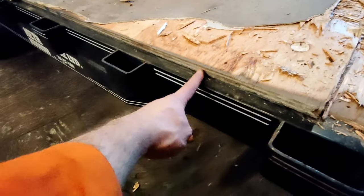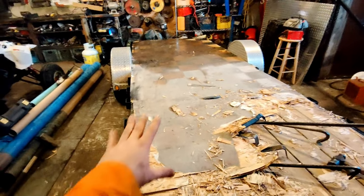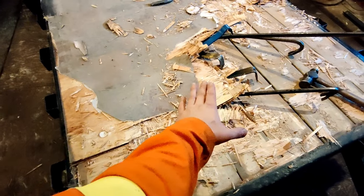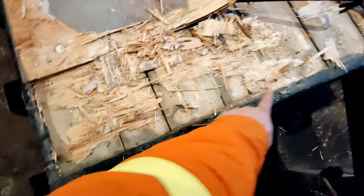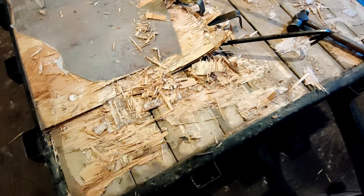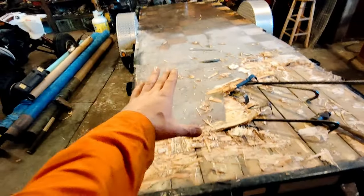Because the plywood sits up a little bit on this edge and I don't like that - I like it flush. I like these boards flush with the frame. Ripping up the plywood and the vinyl on top of it, which is pretty bad. I've seen that with plywood on top of wood, it creates moisture build-up and it can rot the boards out. Down here on the front, where the plywood was on top of these boards, there's all moisture - so that's not good. Better to keep these open boards with the seams going this way.